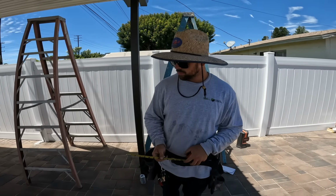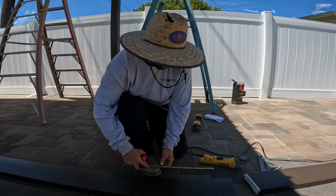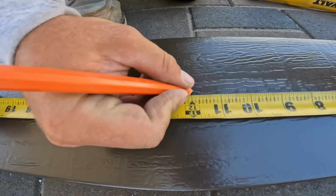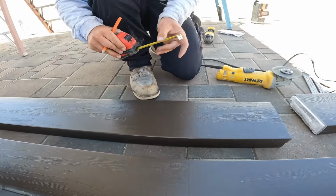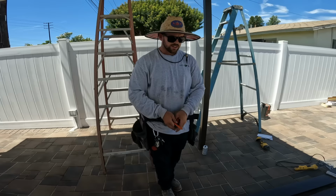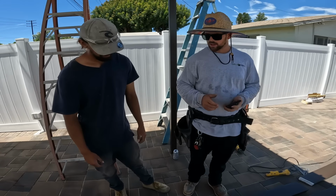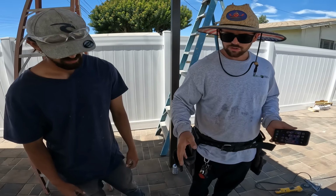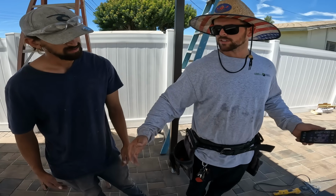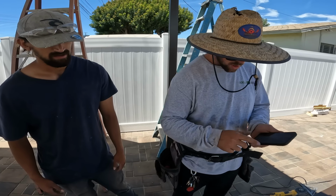Now, as I was saying, we have the cut done. All we're gonna do is measure from top and bottom, 12 inches. One right there. This whole side plate is about 93 inches. We're basically gonna find the next holes for the center, but spaced evenly from the 12 inches from top and bottom. How we're gonna do that is quite simple.